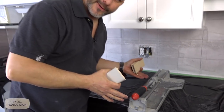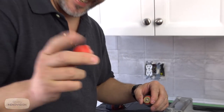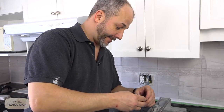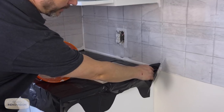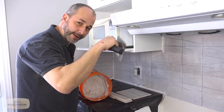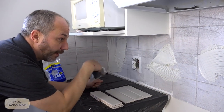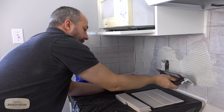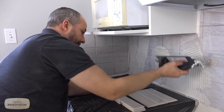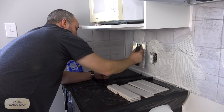You can see how good the cement is — that's got grab. I love to use this because I'm going to be taking this tile straight across the back of the stove area and this stuff will keep my tile from slipping, so I don't have to put any temporary bracing in place. The technique is simple: just throw a few blobs on the wall. It's not going anywhere because this is really good cement for this situation — you want to be able to take your time. This cement holds everything right to the wall and gives you about 15 to 20 minutes of working time, which is plenty of time to get your stone cut and installed.